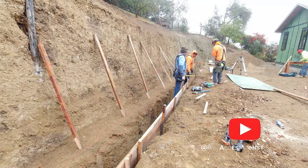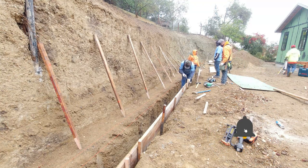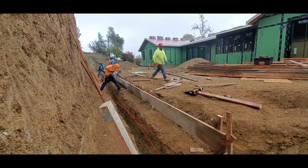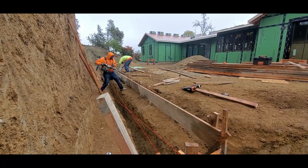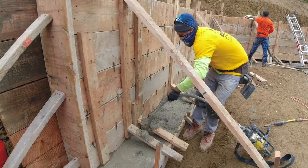You may notice those two red lines. The first one is the face of the wall, then there's an 8-inch separation, then there's the back of the wall. Here we're using a Makita rotary hammer to pre-drill for some stakes since the dirt was pretty hard. The stakes help secure the 2x12s when we pour and vibrate the concrete.